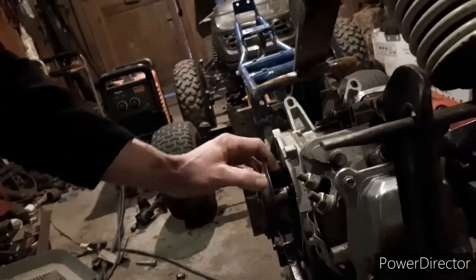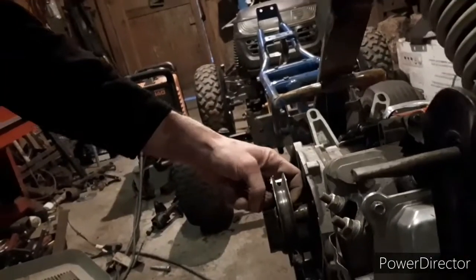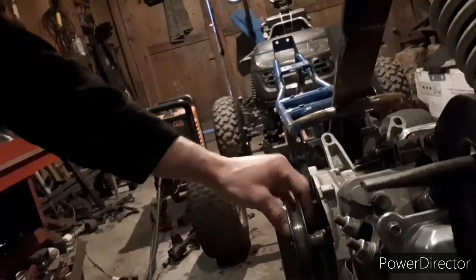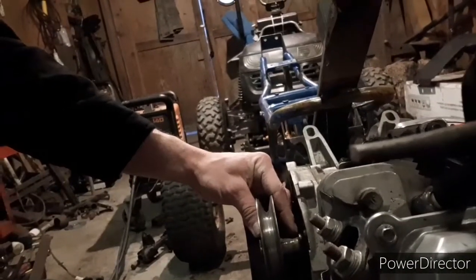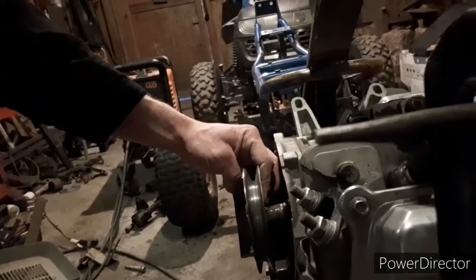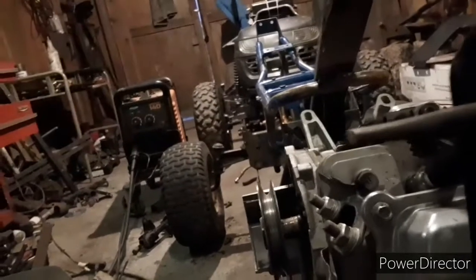Let's see here. Just do a piece of rod for now, but I'm going to try to take this off, because it's welded on here. I have the bolt taken out. I'm going to try and bust this weld and fire the motor up and use it as its own lathe, so I can try and mill this crankshaft down, starting where this little groove is at the tip of my fingernail, out. That way I can fit a clutch or a torque converter or something on here.